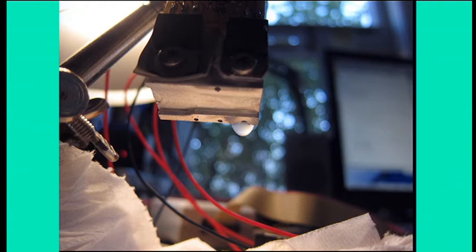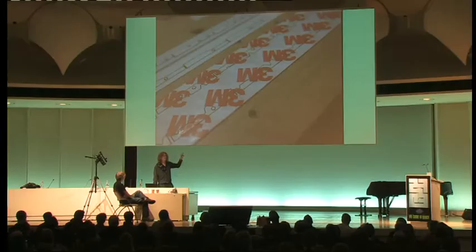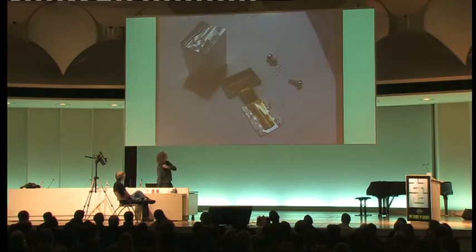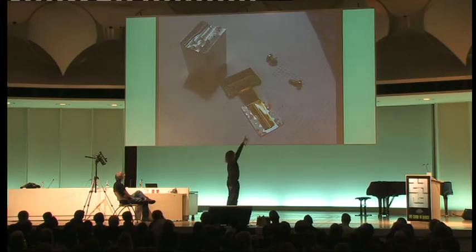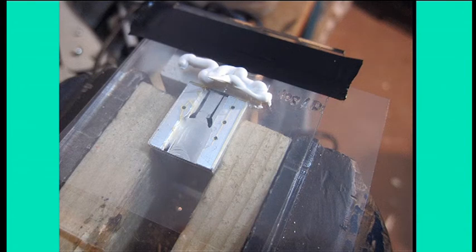Looking at the bottom of the printhead, you can see the heater, the transistor, the temperature sensor, and a droplet of liquid wax dribbling out — so that part is sorted. We've got this heated block to couple onto Epson's printhead. You've got an aluminum block with four holes and the printhead with four holes and you've got to join them — and this is not easy. My first approach: I used double-sided sticky tape, laser cut into precision gaskets exposing the four holes, then bonded it onto the printhead. But it really sucked — really leaky, and not much of the wax ended up where wanted in the printhead.